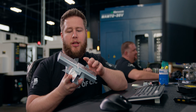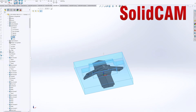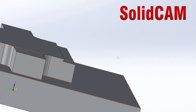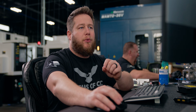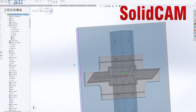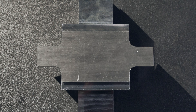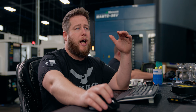I want to spend a little time taking you through my process so you can see how we got here. I'll activate my stock — the first operation is mainly just a dovetail operation, but I wanted to use that op to get rid of a lot of excess material so I don't have a really thin hat around my vise. I roughed that out in a shape just a little bit bigger than the Chevy emblem itself, and you're going to see why that matters when we look at the next operation.